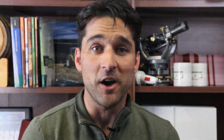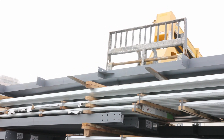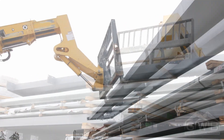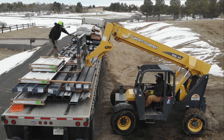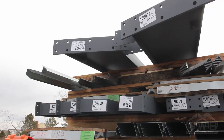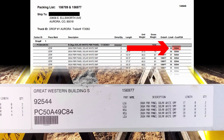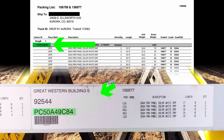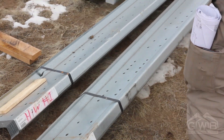Once your driver is parked at your unloading area and they have unstrapped the load, it's time to start unloading. If you have the space, you should set it up to access the load from both sides of the trailer. A couple of extra hands will help you line up the forks, move and stack dunnage, and verify your parts and bundle numbers. Your building parts and bundles will be labeled with your Great Western job number and a bundle number that matches the shipping documents. You should write on your copy of the bill of material immediately with each bundle you unload to check them off.